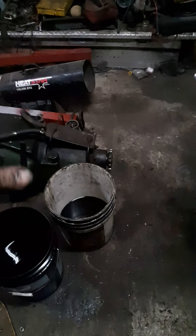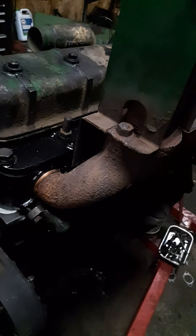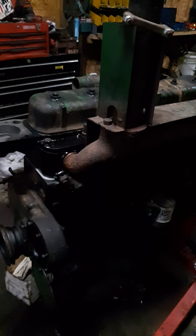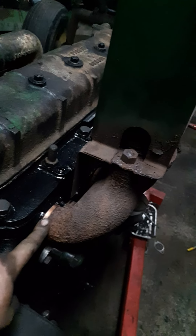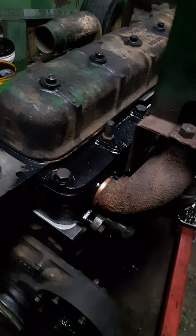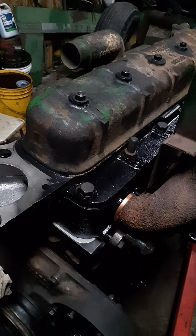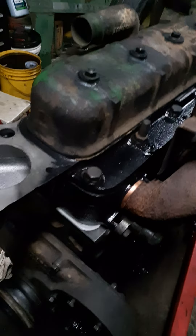I know it's not right, but money is tight right now because we poured money into this head. These heads are getting obsolete — almost every single Oliver head you get is cracked or warped. So we ended up getting a whole new gasket kit from a local parts store here called Mayball Tractor. They've got all this stuff for Olivers, Cockshutt, Case — you name it. I just got her back together, torqued down, and had all the valves adjusted properly.